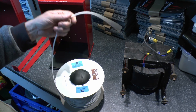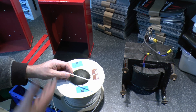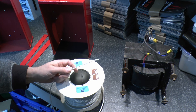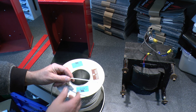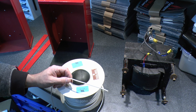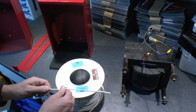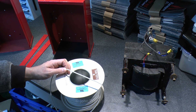So we're going to extend these in length somewhat and then they'll just come straight through into the other unit. Now for wiring we're going to use this, which is white — we've got a big roll of it here — just going to use everything as white and just identify the ends appropriately. Now this is what's called tri-rated. There seems to be this mystery about what tri-rated stuff is, as if it's some kind of magical wire, but it really isn't. All it means is it's just been manufactured in such a way that it meets three different approval standards, and therefore you can use it in various different countries. Most importantly you can use this for stuff in North America because it meets those standards there, and of course you can use it in the UK and Europe as well. So tri-rated just means exactly that — it has three different approval ratings.